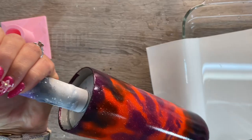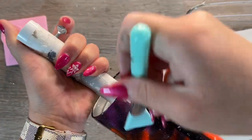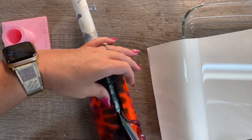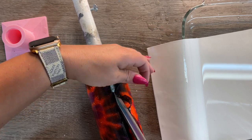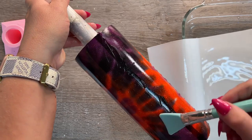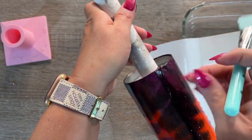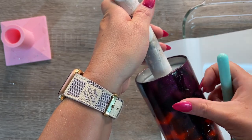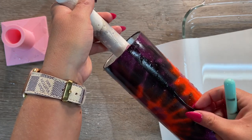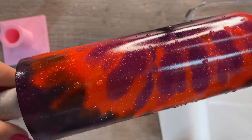What you're seeing now is me going around with my wet silicone brush, squeegeeing out any remaining bubbles. Keep in mind it is contracting and shrinking as it's drying, so you may have no bubbles at first application and then a few minutes later more bubbles will show up because of that shrinkage. Keep going around for the first five minutes or so to double check no new bubbles have popped up. I trimmed off the excess along the seam with scissors but kept about a half inch of overlap — because the edge of this pattern is so dark, you really can't tell. I'll let this dry for about 30 minutes, and I left all the water on the surface to help it while it shrinks as it dries.